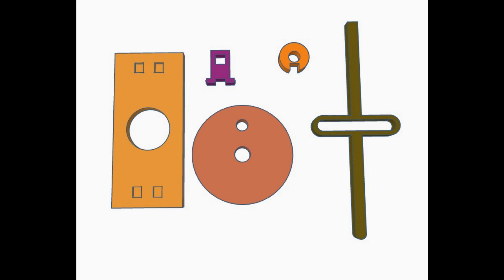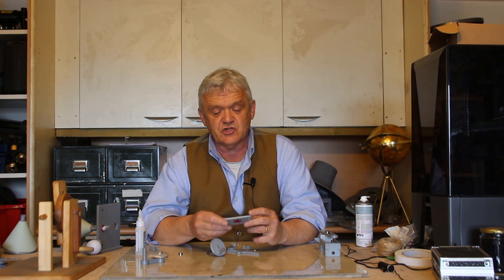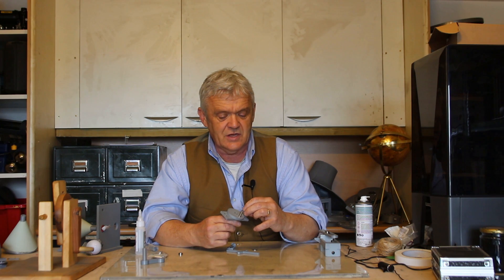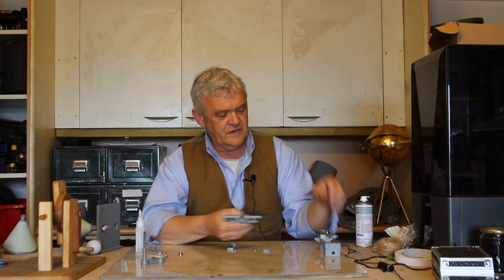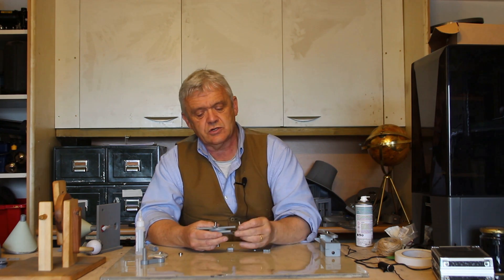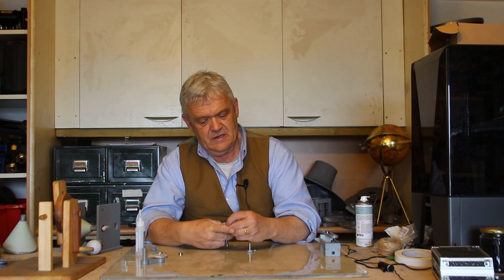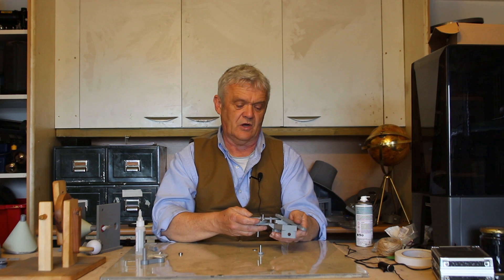To make the scotch yoke, you'll need these parts. In the wheel I've put a dowel pin and a piece of 8mm bar as the input. In the base plate I've put a 22mm x 8mm skater bearing so the wheel can turn freely. There are two square slide guides that fit into the yoke, which has a flat section facing the machine and a rounded section. A small ring piece gets one of the 6mm shelf supports glued to the end of the bar. Put the square pieces on first, then glue the ring on, attach the squares to the base unit, and glue the base unit on.